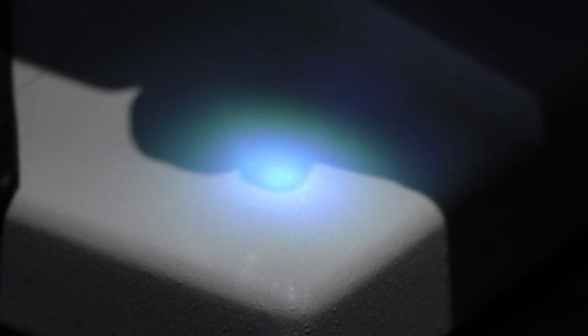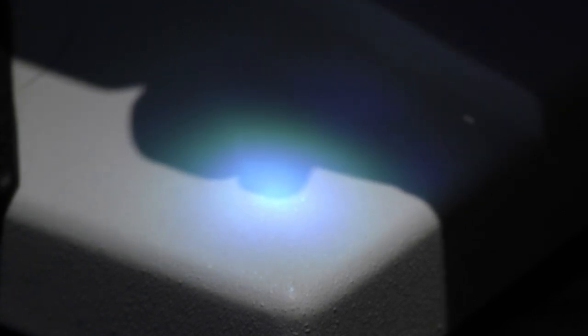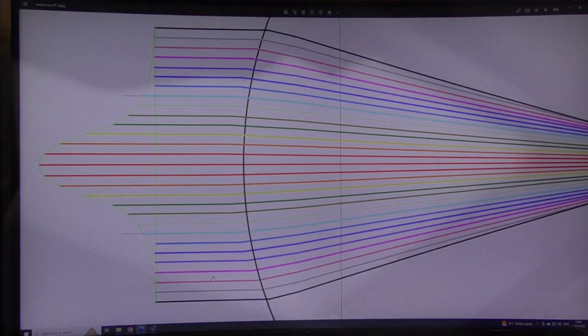That is what our laser beam is like, whether it be a diode laser or whether it be a CO2 laser. It's a characteristic of the laser beam. It always has a very high intensity of energy or light right at the center of the beam, and it drops away in a very predictable manner called a Gaussian distribution. Normal distribution to statisticians, or some people might know it as a bell curve. Let me just show you.